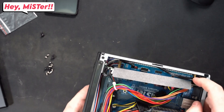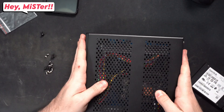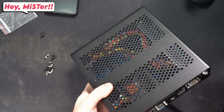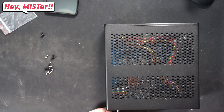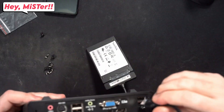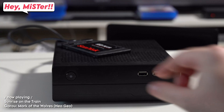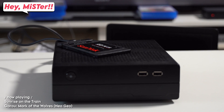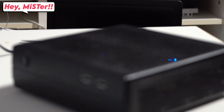I did a trick with the power supply using standoffs for mainboards to free up the USB slot, but I still wasn't able to connect the SSD that way. So I decided to do a test run with the SSD connected just to the back side. Connecting HDMI — the big moment of truth — and nothing at all. That was because the SD card was in the back slot and not in the DE10 Nano. I fixed that, turned it on again, and it worked.